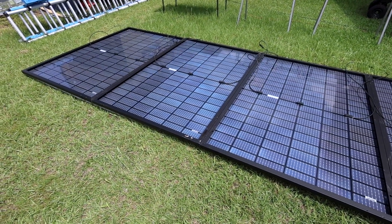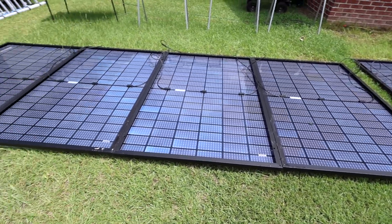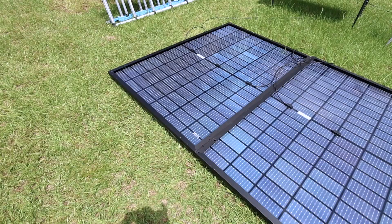As we can see, we're well above that rating. Facing them to the sun and just laying them on the ground, we're getting 216 watts when the rated max is 124. I don't have ideal conditions here — no concrete surface on this side of the house for proper bifacial reflection testing — but you can tell they'd probably still pull in that 124 watts at the right conditions. The bifacial portion experiment — I'll say it passed.